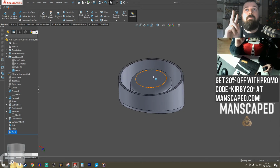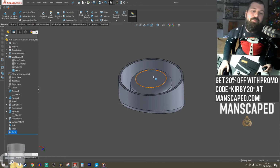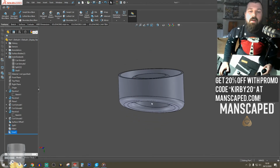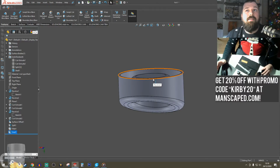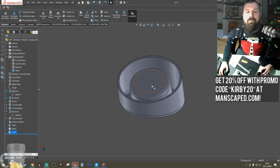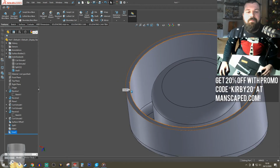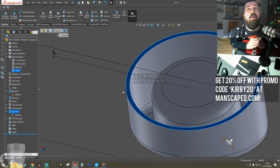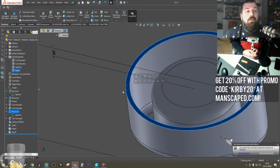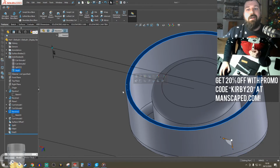So, two problems are going to happen here. While it's printing on the resin printer, this is going to create suction because it's a little cap here. But also it's an island, so I'd have to end up putting supports here. To avoid that, and this is the beauty about 3D printing products, if this was, for example, vacuum formed or injection molded, I'd have to keep a consistent wall thickness all throughout. Because this is being printed, you don't need to follow those rules.